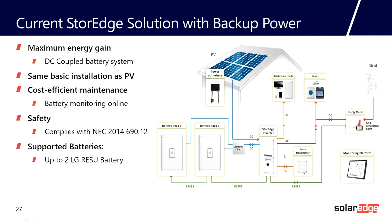That's 4. One to the Autoformer. That's 5. And then probably the communication wires in the same conduit. So we don't have to worry about any other communication wiring. So that's 5 conduits. Preparation is key if you're going to be successful for your first installation. And I would say use a gutter box on maybe your first install, just so you have the space and the ability to move things around and make sure it's clean and tidy.